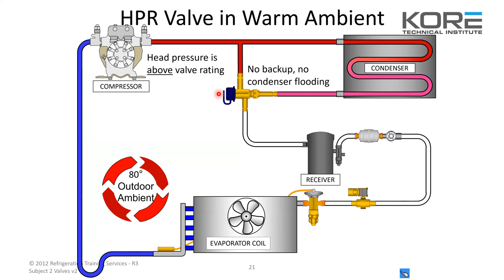We've had some running head pressure down way too low in the wintertime — correcting to the higher set point fixed it. Always look at your part numbers and know what you're dealing with. A hold back valve on a rack is the same concept — stacking liquid refrigerant in the condenser to lose condensing capacity, which maintains head pressure high enough to push down to the cases and get a good pressure drop across your valve. Make sure your charge is adequate. I can't tell you how many return calls we get on ice machines — I've taken customers away from other companies because they can't properly diagnose a headmaster on an ice machine. If you go out and everything's running great but they call the next day saying it locked out overnight, think about the temperature difference from day to night. Go after that head pressure control — cover the condenser, run it up, see what it does.